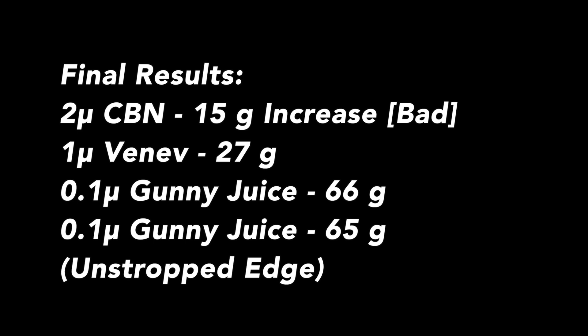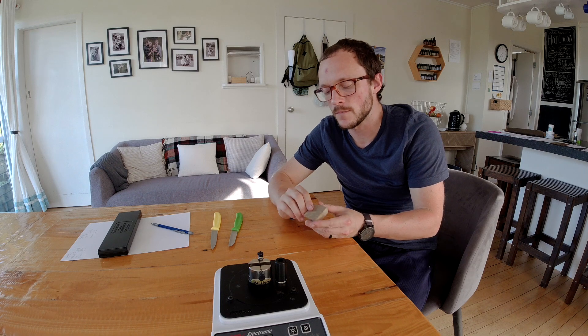The denim strop seems most effective for tackling that initial larger burr, but 240 and 260 were perhaps too high — too much burr to begin with for an optimal deburring sequence. Preliminary result number one: the sweet spot for deburring off a ceramic stone like this Spyderco seems to be getting it between 150 and 210 to begin with. I'm having the best luck getting the burr to pop off when starting at that already-deburred level. These results are consistent with other denim stropping results.